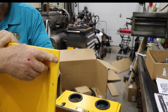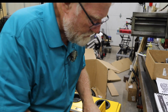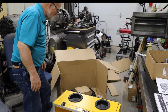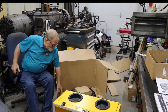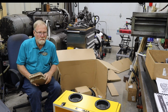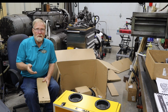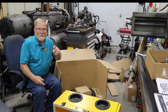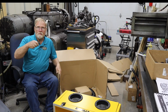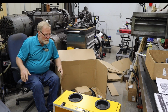When I have to straighten this flange out, it's bent, won't bolt down flat. It's all metal. And right now I'm not sure if that's all good or not, because when you're blasting, especially with heavy grits, it eats away the metal. My big commercial one upstairs has got rubber mats along the places that you would direct the stream of metal to, mostly, and where it bounces off the sides.